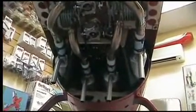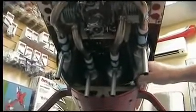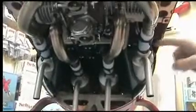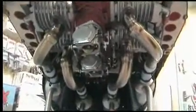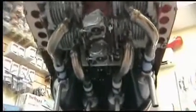It was a little bit difficult to fit a 2-in-1 system in this aircraft because of the undercarriage plate. It was extremely difficult to get the 2-in-1s to go back up over the top, so we opted for 4, which required us to open up the side of the engine dome. Took a little bit of measuring, a little bit of cutting and shutting with the header system, but the header's all fitted nicely into place, as you can see, and all seems to work quite well.